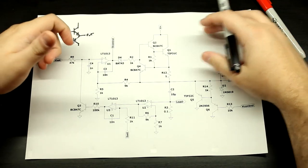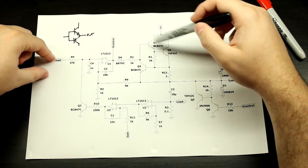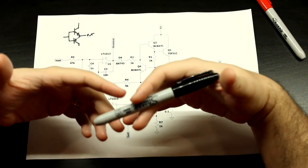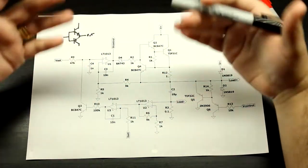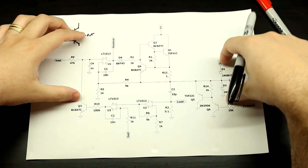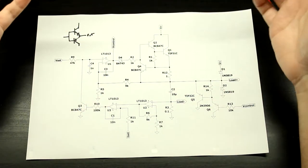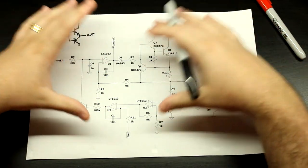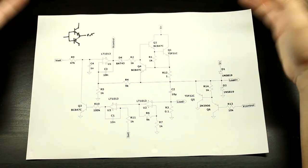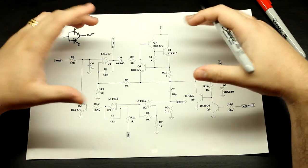We'll need to put a lot of protection on the control circuitry of the high-voltage pass elements, because the output voltage is going to be set by a very low voltage signal. If any sort of high voltage from your B-plus comes into the input, it's just going to destroy the whole thing. We're going to be adding circuits like this basically everywhere, and it's going to be a discrete op amp, so a lot of protection is needed. For low voltages like this, though, this is more than enough for whatever you want.